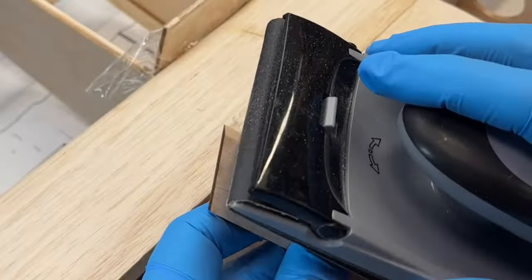All right, well, this is curing. I can go ahead and start cutting the planks to fit in this nose area up on top here. So I'm going to cut a few blocks like this, a couple pieces. And then once this all cures, I'll take these off, obviously, and I'll trim this and this upper plank, and then I'll set these pieces on and then shape the entire thing together.